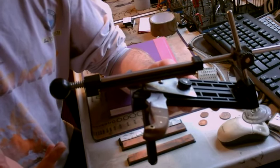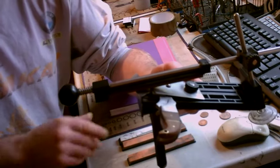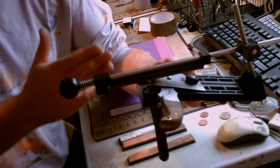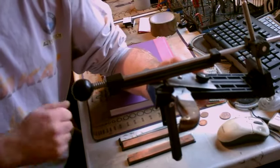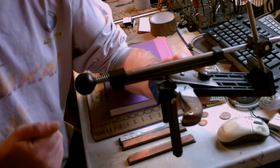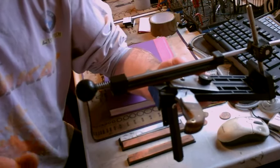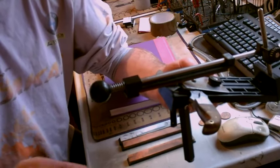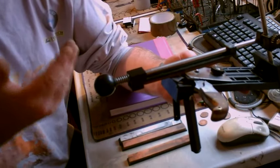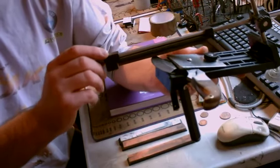Although technically I don't do razor sharp, because with razor sharp you'll get a cutting edge that you can chip. This metal is so hard, so incredibly brittle, that if you get down to sort of a 10 degree cutting edge that you can strop and produce a really razor edge from, that cutting edge becomes so incredibly brittle. Even if you're skinning and trying to de-joint, like a knee joint or a hip joint on an animal, you'll chip the blade. That's how brittle that becomes.